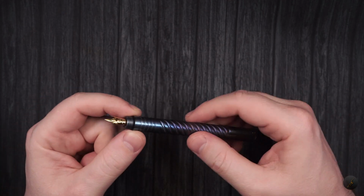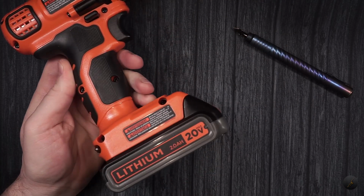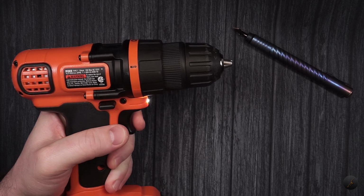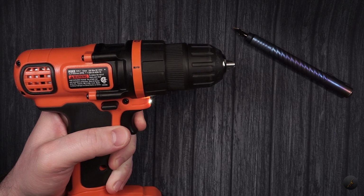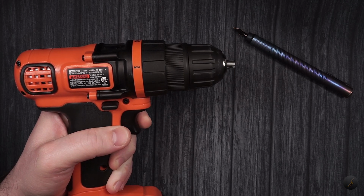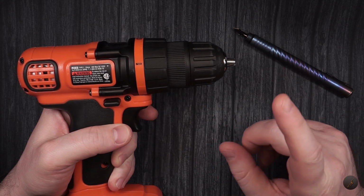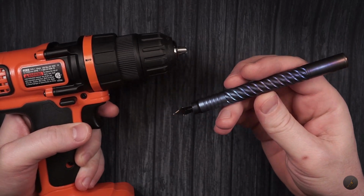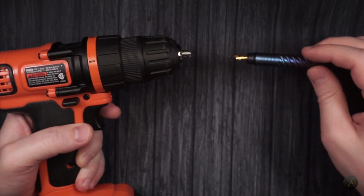So once you have this ready, the tools that you're gonna need, give me a second, I need to grab something. It's one of these, right? Just a hand drill, a cordless drill. Something that you can sort of control the speed of, either by trigger or by some selections that you might have on it. This is important because basically it's gonna spin, you need a way to spin the metal, or make it much easier for you to work on it.